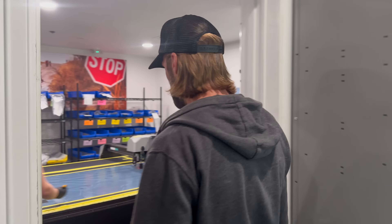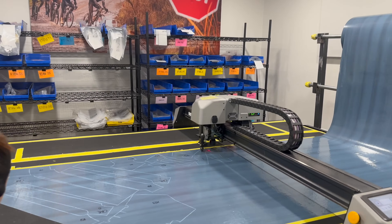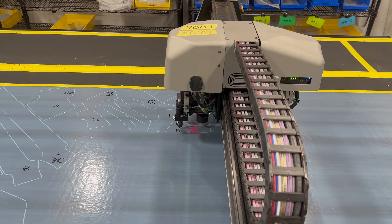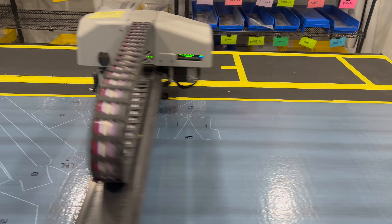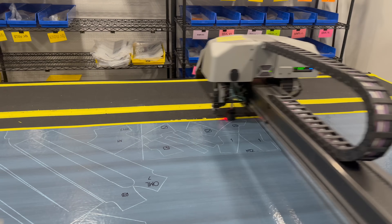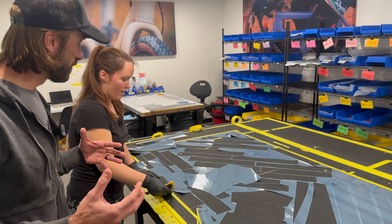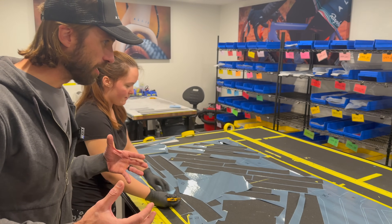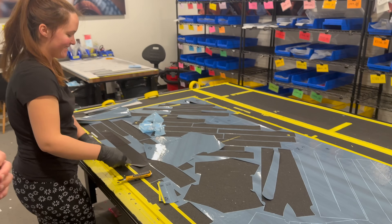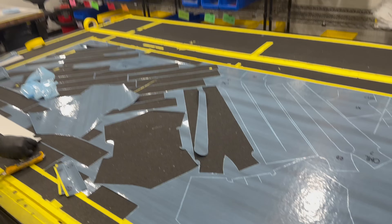The table is running. What you see being done here is unidirectional pre-preg carbon fiber from Mitsubishi, based in California, being cut into a bunch of tiny pieces. It looks like we are doing head tube pieces for an Alpha road bike. All of these pieces are just for the front triangle of an Alpha, which is our road bike.